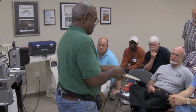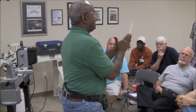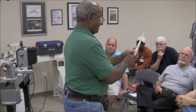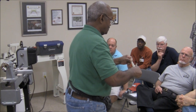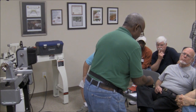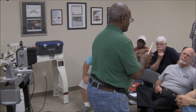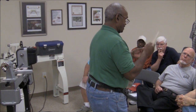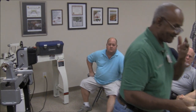Take care of that. And then I shaped it, kind of do the shape this way. All right, so I want to come down. I don't want this to be too thin because I want it to still be good and strong. Now, to get it finer all the way around, I go to the palm sander. What I want you to watch is from here down, how finished it's going to be when I come off the palm sander with it. And still I'm using 120 grit paper.